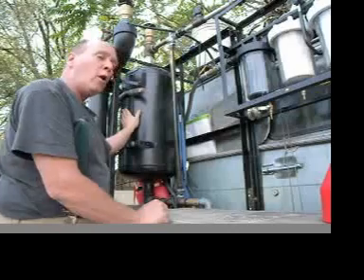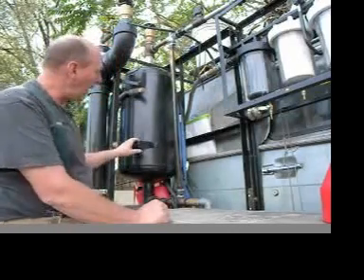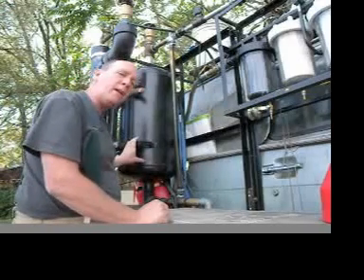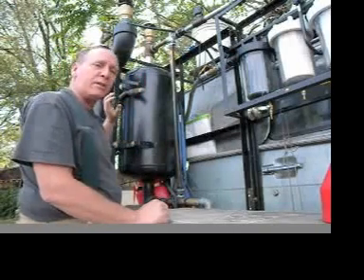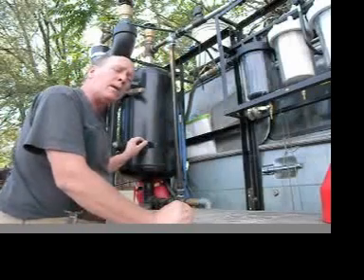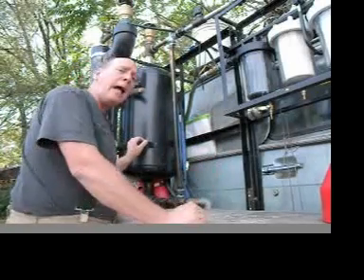This is a 20-gallon or 80-liter tank. I basically put about 4 gallons of gasoline into it and then 16 gallons of vegetable oil. Then maybe I drive around the block and let the solution settle for anywhere between an hour to overnight.